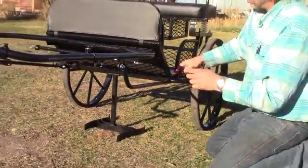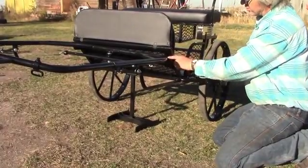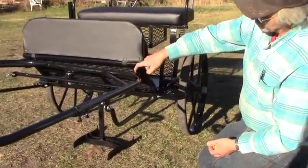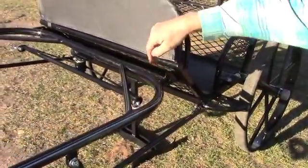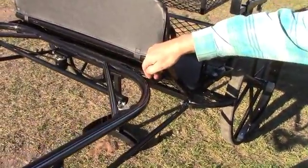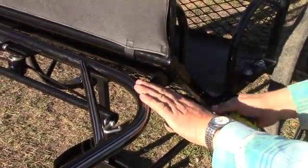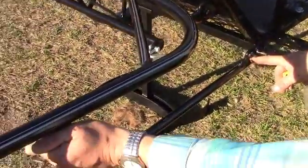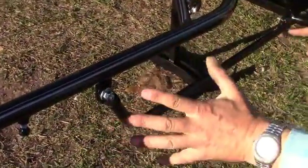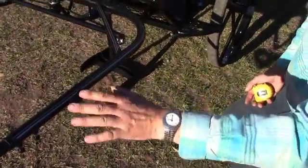Okay, with them, then you can take your shaft base and it just hooks onto these bolts. This bolt is a welded nut in here. It'll be threaded in but loose. The shaft base will just hook in there, and then you can let it sit down, tighten it up a little bit by hand or just loosely with a wrench, and put this bolt in. Then tighten this down and check it on both sides, of course, and then you can start to set the cart up.